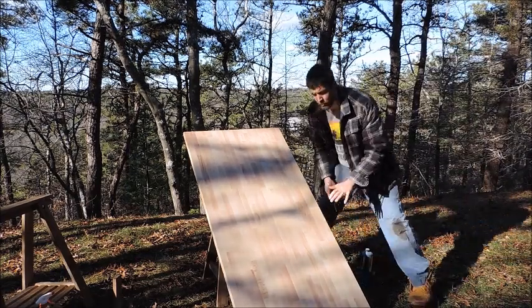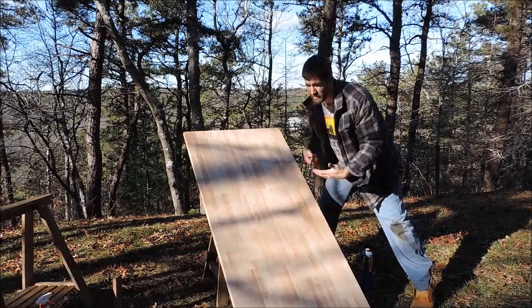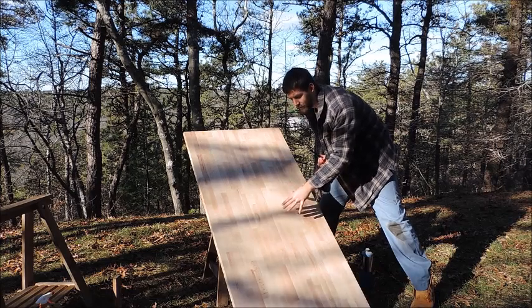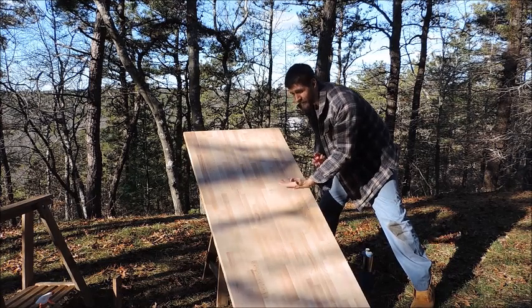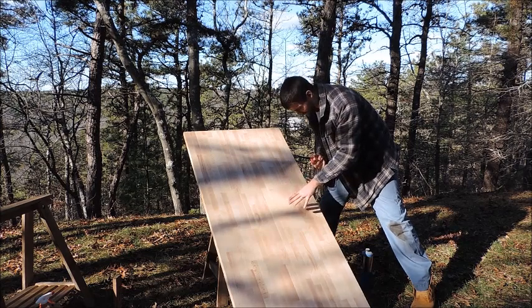Okay, so just a reminder of what we're doing here with the blowtorch. Aside from physically burning the wood, there's probably going to be a little extra color in here because this wood is so sugar rich, and so it will actually caramelize some of the sugars in here and add to that golden brown look.